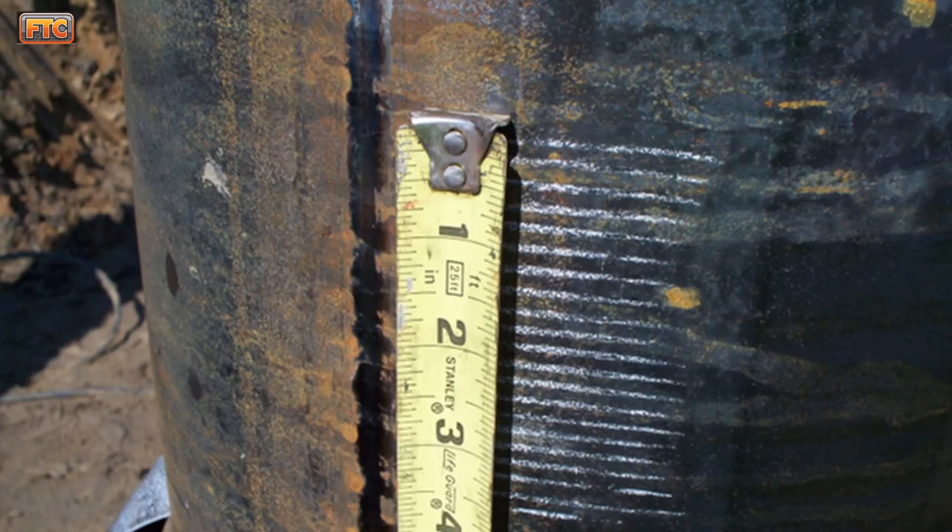It's important to accurately measure the hammer ram stroke. If we do dynamic pile testing, we'll determine the capacity at end of initial drive at some depth for a given pile, and we'll correlate that with the stroke recorded in the PDA computer. The PDA has an internal clock and timer; through a formula it's able to calculate the stroke on a blow-by-blow basis. For recommended driving criteria to achieve a given capacity, we'll recommend a minimum hammer ram stroke and a maximum pile set. Pile set is the penetration of the pile over some consecutive number of blows — typically measured over five consecutive blows, for example an inch in five blows.